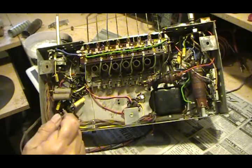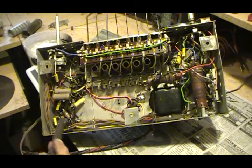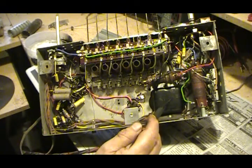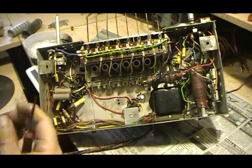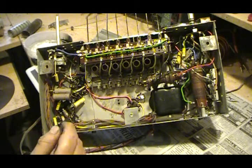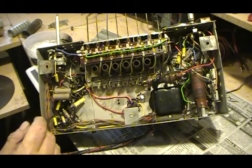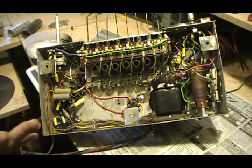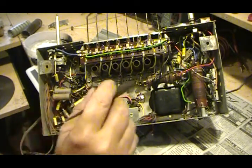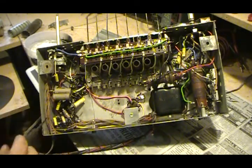Over here is a totally different story. In the audio section, you have no filters. The only type of filtering you have in here would be like a tone control — and that's actually to take out the high sides, not the low sides, and this is the low side. Your tone controls are generally designed more to bring in bass. Well, 60 cycles is pure bass. So if it was over in here, it would seriously cause a lot of problems, and you would definitely hear a hum that there's nothing you can do to get rid of it. So they try to keep the power supply as far away from the audio circuit — not the front end — mainly because of the frequency differences, the filtering differences, and the like.